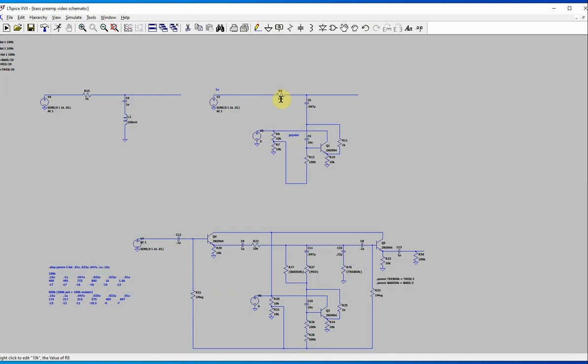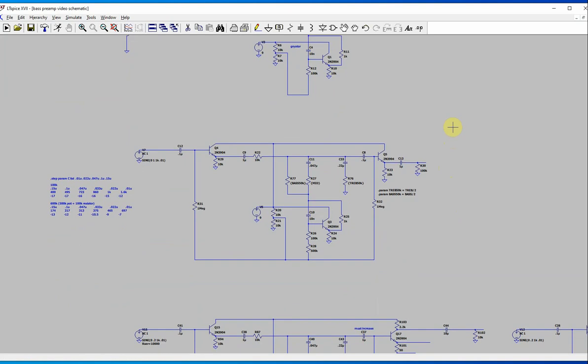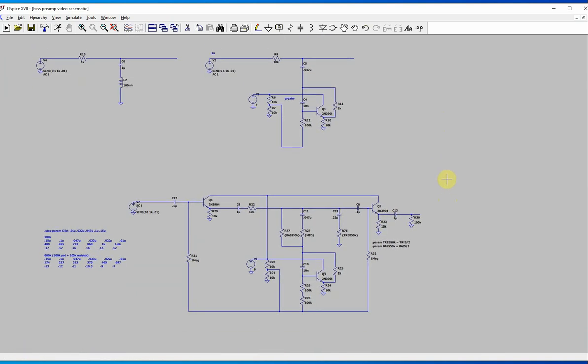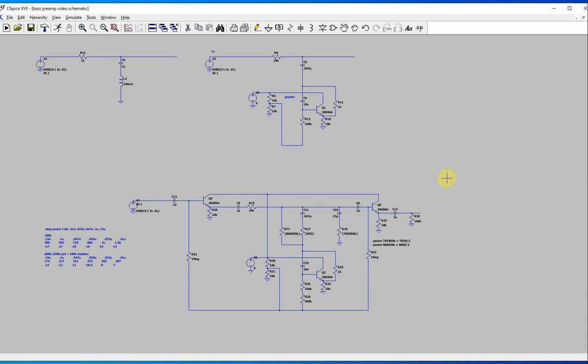So it's kind of limited. Like if you want to make the Q wider, you increase this, for example, and it's going to actually reduce the whole signal a lot. I'm just trying to tell you what some of the limitations of the circuit are. There's already going to be a little bit of loss here just because of this voltage divider that's formed there. But, okay, it gets a lot more complex depending on what you're looking at here.